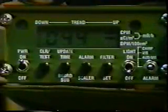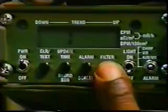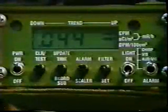When you prepare the meter for a beta gamma survey, select and set desired features. This includes setting selection of filter, update time, chirp, alarm, and alarm set points. Always do a background count. The probe can be carried in the pouch or held in the hand during survey operations. For gamma detection, the window cover on the end of the probe must be closed. It is open during beta detection operations, and the audible alarm should be used to allow the operator to watch the positioning of the probe rather than watching the meter display.